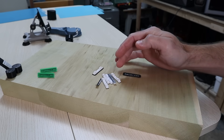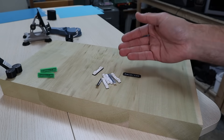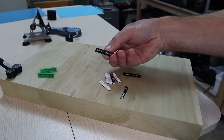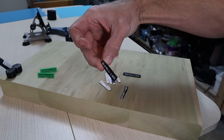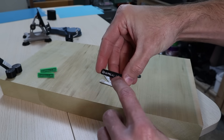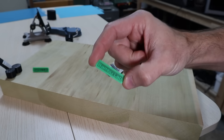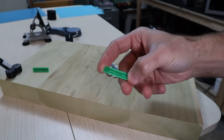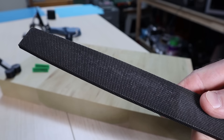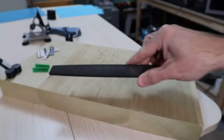Here are all my samples, and quite a few more didn't turn out at all — nothing to even show. Some had partial adhesion, some had decent adhesion but still didn't turn out well enough. If you go deep enough, some layers started to turn out fine. I'm going to grab a file and remove that 0.1 millimeter layer thickness, then finish it off with sandpaper. If you don't have a file you can go right to sandpaper — this is just a very old dollar file I've done rust removal on, so use whatever you have.